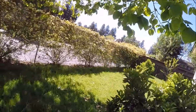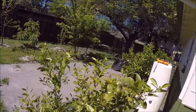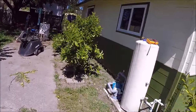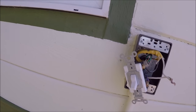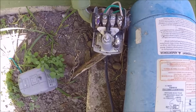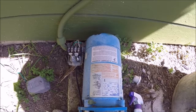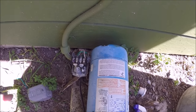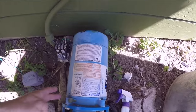Before I even had the channel, I had rebuilt this whole well assembly back here. It has a 40-gallon holding tank, which is nice - you need a reservoir. She's still holding pressure. I confirmed I have power to the switch, and you also see a sensor relay for pressure here. When the pressure builds up to a certain point it cuts off, otherwise you'd explode all your water lines around the property. So this is a pressure relay right here.